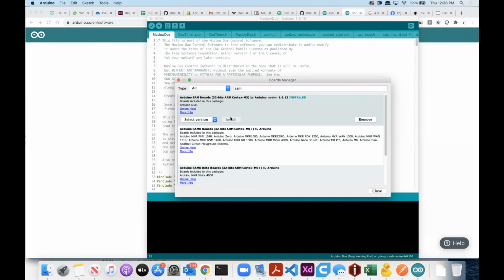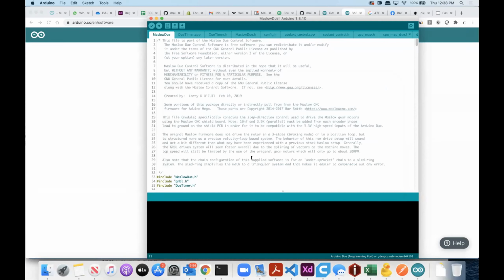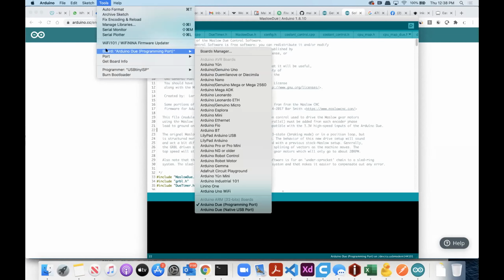When you have that, there'll be an install option. It'll take a little while to download. I can't remember exactly how many megabytes it is, but that'll download. It will install into your Arduino environment. It doesn't make you reboot Arduino or anything like that. And then a good way to tell that it is in there is when you go to boards, you'll actually see those Arduino Due options. Now,